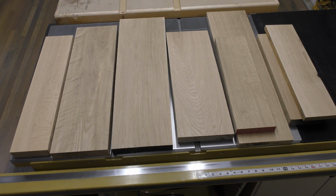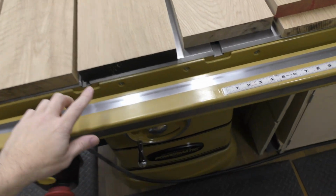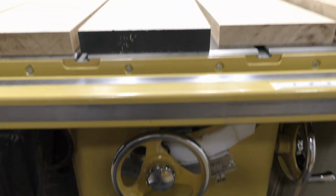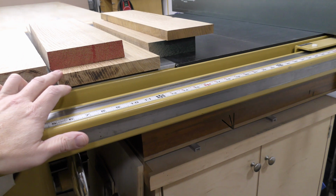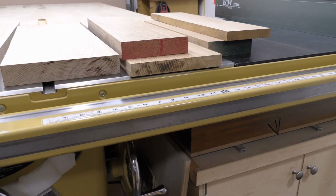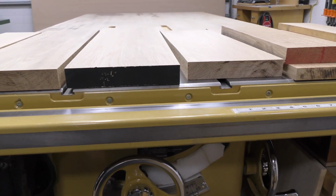So I don't have that stock exactly. What I plan on doing is, as you can see, the 4 main parts that I have are roughly 1.5 inches thick. I will then use these other smaller, thinner pieces and glue them up together, and I will make up the difference, and then bandsaw them down to 2 inches, so that I can make up the stock that way.